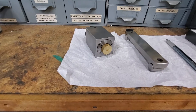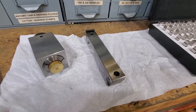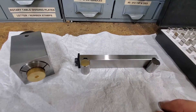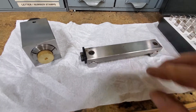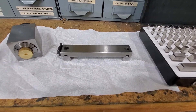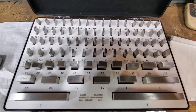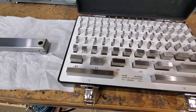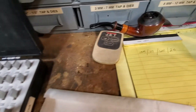The best way to do it — you can use protractors and different things — but the easiest way I find is with a set of gauge blocks and a sine bar. That's S-I-N-E. This is a sine bar; it's a five inch, which is an industry standard. It's five inches from center here to center there. I've got a calculator on my phone called a sine bar calculator. You put in the number of degrees you want, and it will tell you what combination of these precision gauge blocks to stack — in my case, 35 degrees. I've already got it figured out.